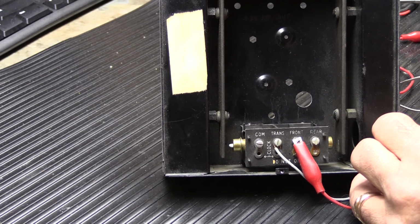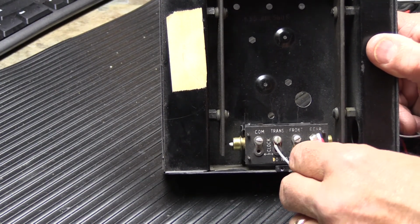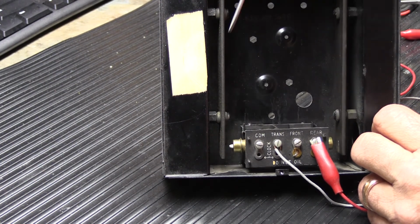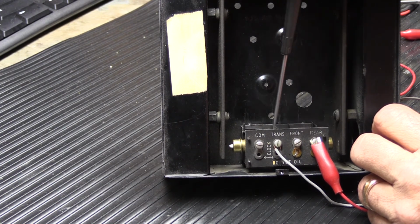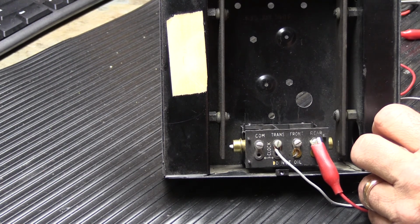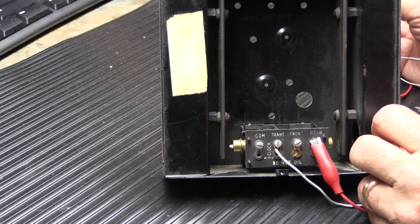It's all about the springs. If you take the springs out, it doesn't work. You need the springs in there to make it work correctly. Now, if we move it over to rear, which is a single note, the single note being just this hand, this side, this is a dual coil solenoid. There's one big coil here, and there's a shorter, smaller coil on the left. When you connect to the rear terminal and you push the button, you're only energizing this side, the left-hand coil, and it makes it pop out on the left,